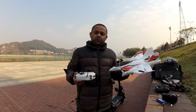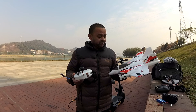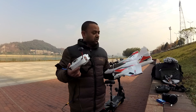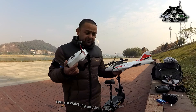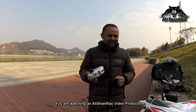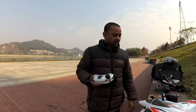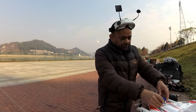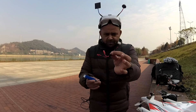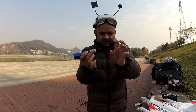I have just installed the Firefly Fortress all-in-one FPV system, which is running a 200mW video transmitter and a Firefly camera. I'm using my Skyzone 030 OLED FPV video goggles and I'll be able to shoot a DVR video for you. I thought I would install a Firefly tiny HD camera, but it's not charged unfortunately, so we'll enjoy the DVR video only. I'll be using the same battery to power the aircraft and the FPV system. For that, I made a small connector which comes from the balance port of the 3S battery and has JST leads.